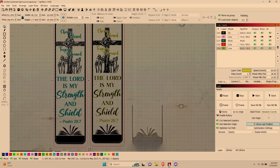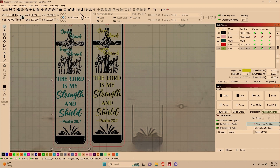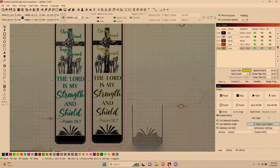If we run these layers as they are, Lightburn will do the black layer first and go back and forth across all this white space, wasting a lot of time — unless we set that to a flood fill, which can result in inconsistent engravings. So what I did was let it run all the black layer at once and then go back and do an outline separately. That shaves about five minutes off: 15 minutes 38 seconds versus about 20 minutes 21 seconds.